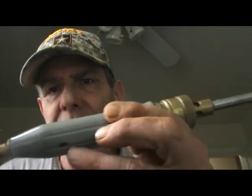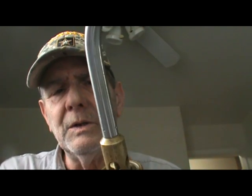So the biggest point of this video is to let you know there is a better way and a proper way and the right way and a cheaper way and a quicker way, and it's the turbo torch. This is a turbo torch, okay? You got one handle to turn on the gas. The air sucks in here, air-acetylene. One tank of acetylene, MC tank, short tank, $40 to get it filled up. And your tip, this is an A8 tip.